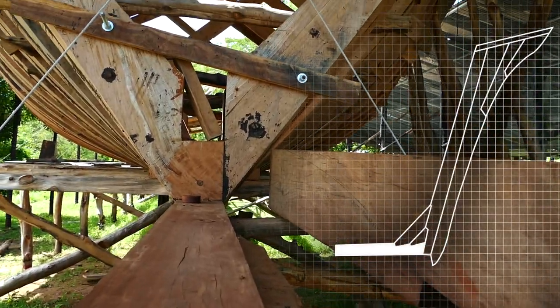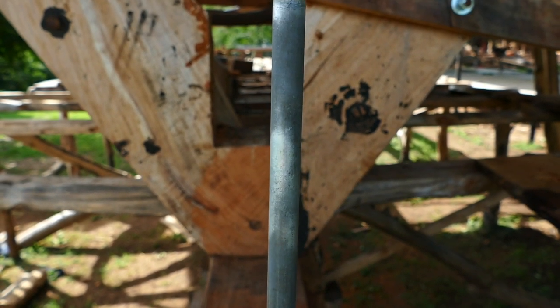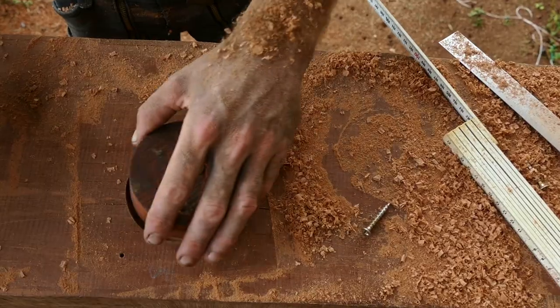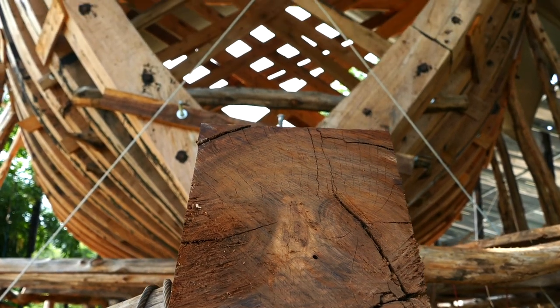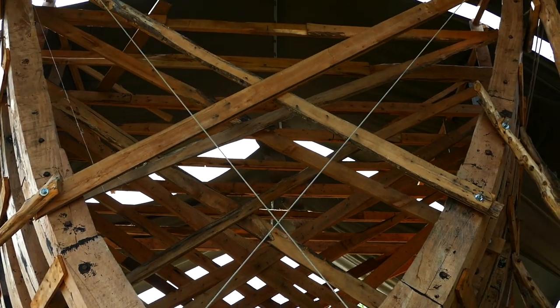Initially the stem is attached to the keel itself, bolted on with big heavy reinforced steel bolts and wooden joinery. Then the entire hull comes fastened to the apron. We are almost ready to install the stem — it feels really good to finally get her up. It'll give another dimension to the ship itself.